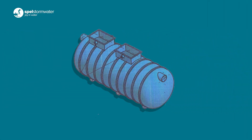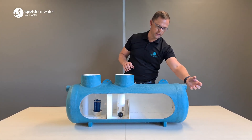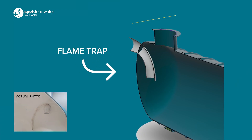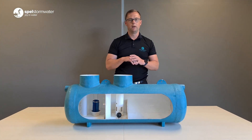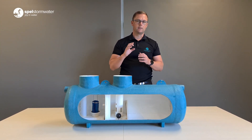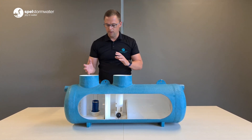The next critical thing that makes this separator work really well is the shape of it — it's long, relatively shallow, and relatively narrow. When your flow comes into the inlet, there's a little flame trap and a little elbow which directs the flow down and keeps all the turbulence at this end of the separator. You then get nice laminar flow going through the rest of the separator, giving lots of time for the small oil droplets to rise up — and some of those oil droplets have a very slow vertical rise time.